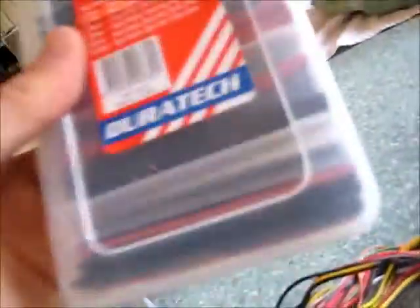I'm going to do the same here. I'm going to cut these connectors off and group all these to each separate rail, then go over them with heat shrink, neaten them up and put crimps on them. First I'll cut the zip ties off and grip all the wires, then we can strip them, crimp them and then heat shrink them.